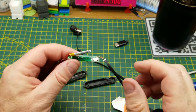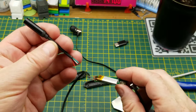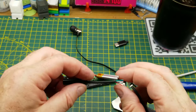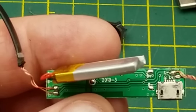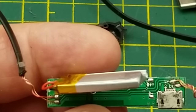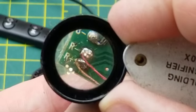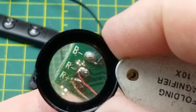Now I just have to figure out which end I want to put this thing on. It looks like I may have to steal some thin wire from somewhere because that's not quite long enough to get to both ends. I also need to figure out which is the common — but I should be able to just ring that out with a meter. What would have been even easier is to look closer, because they're labeled plus and minus, and the minus is in fact the common one.